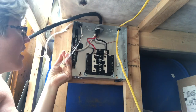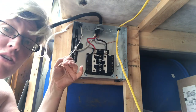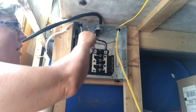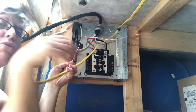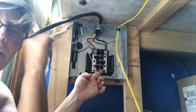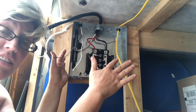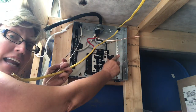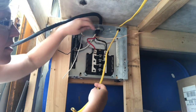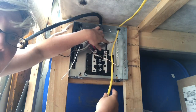Here is the 14-2 gauge wire — this is with all of the outlets. Again, this is what I am doing; that doesn't mean I'm an electrician or this is what you should do. This is a ground wire. Sometimes it's encased in green or it's just the copper wire. The ground goes into the ground bar that we put in. There's the ground bar. This is the neutral — this feeds electricity back to the mainframe. This is hot.